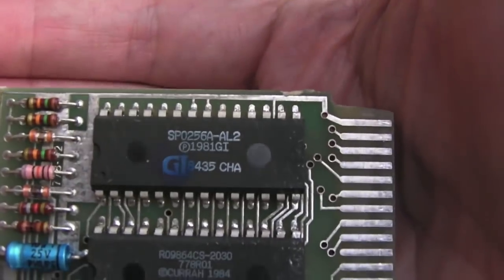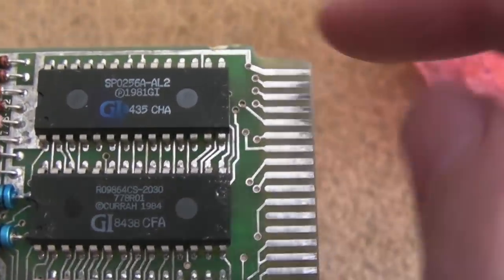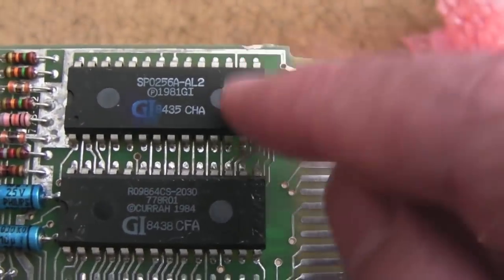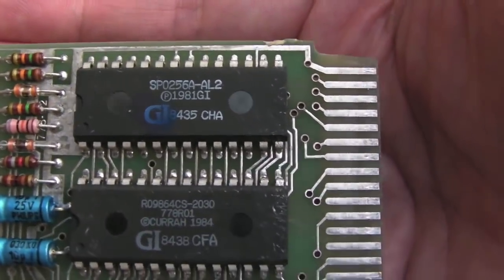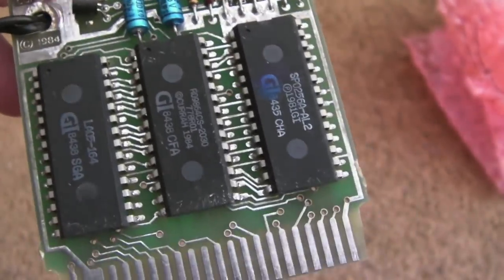It's exactly the same speech chip as in the previous video on the Spectrum MicroSpeech. I've got a couple of spare chips from Alice O'Shalos's original spares collection. Before powering this up I checked the pinout — the left-hand pin is ground, the two next to it are VCC with the chips facing upwards. When I switched it on you could hear sound, but there's no video, which is worrying. Feeling the tops of the chips — they are stone cold.